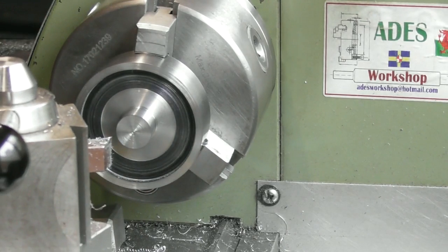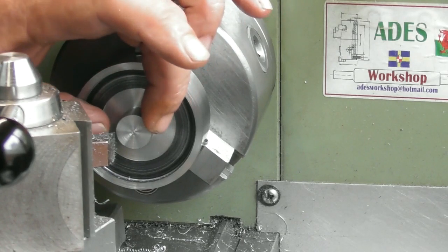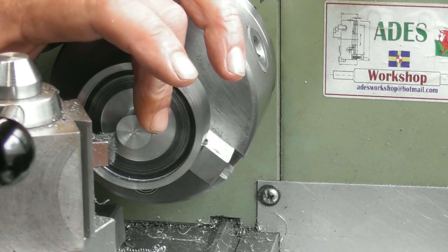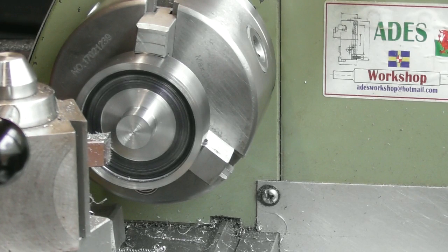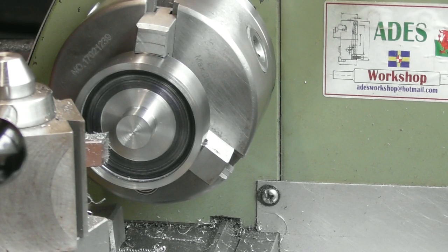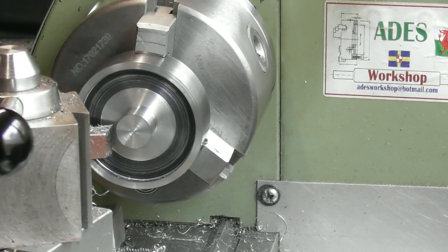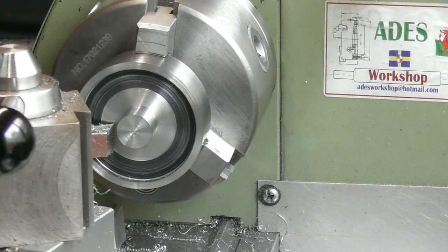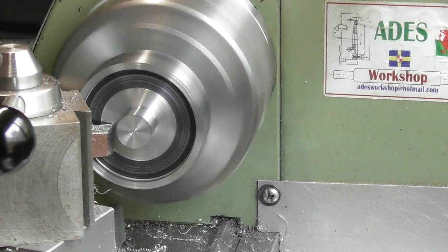Okay, so at a point 22 mil out, I want to undercut. So 16 to 22 is about 6 mil, so that's 3 mil a side. I'll just set a 0 on my DRO, we'll wind out 3 mil. There, and I'm going to set a 0 again. Now from a point, I don't know, let me just flick my monitor around. From a point where I am now to the outside lip, I want an undercut at 0.25 millimeters. So I'm going to set up what I can get to of that bit now. So that's going to be on a reading to 11.25 now.